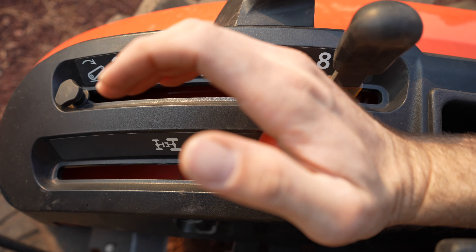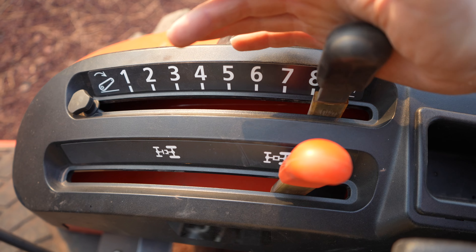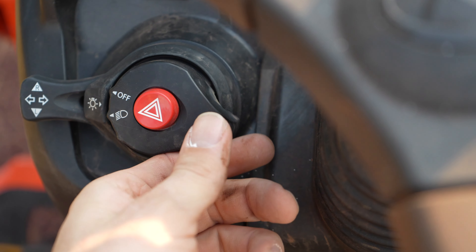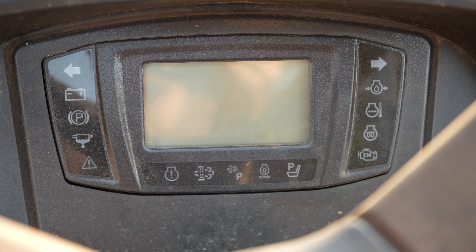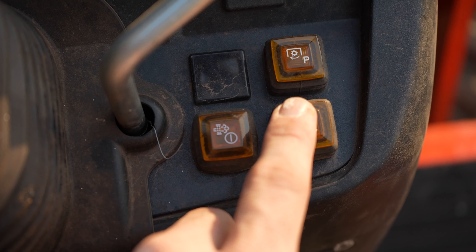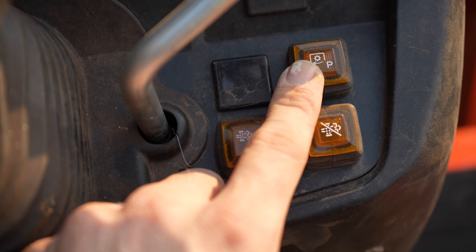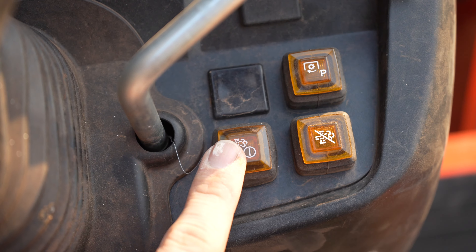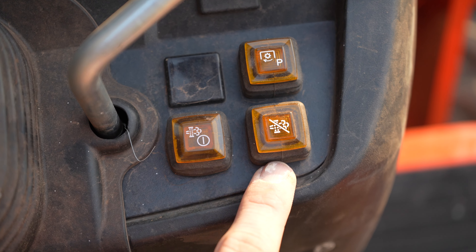On the other side we have four-wheel drive and two-wheel drive, and then this is your adjustment for your three-point hitch in the back. Up front on the dash we have left and right blinkers, headlights on/off, and hazards — which stay on when the tractor is off, which I'm not happy about because I ran the battery out once. On the other side you have your emissions control button, and then a parked PTO button. If you want your PTO running while you're not in the tractor — like running a generator or wood chipper — you just hold this down for a second.